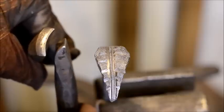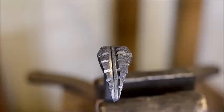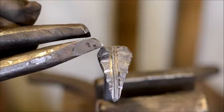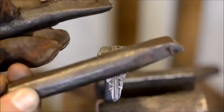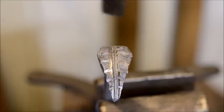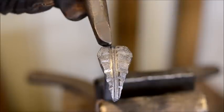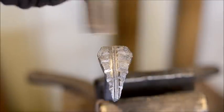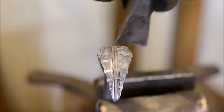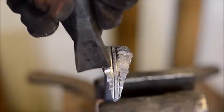I was taught how to make these with Tom Latney. He showed me how to make these tools for chasing into steel. These are quite thick. They can be used cold or they can be used hot. They're just made out of some coil spring. But essentially, I took the butcher tool with the leading edge facing that way and went down one side, then the other side, and then I took the curved butcher tool and made a bunch of chop marks down one side, down the other side.